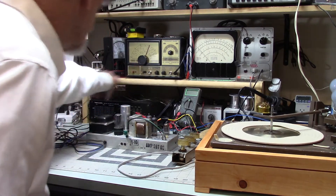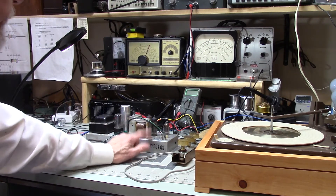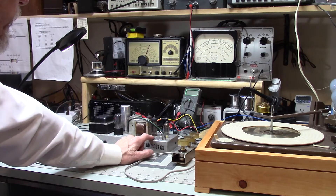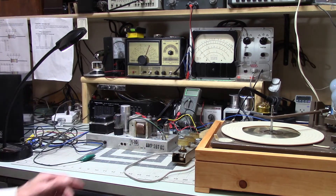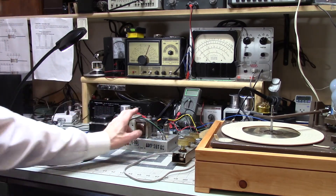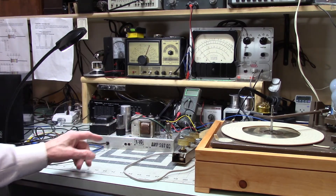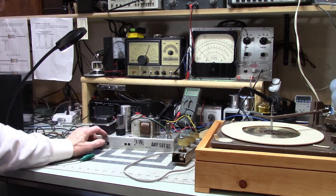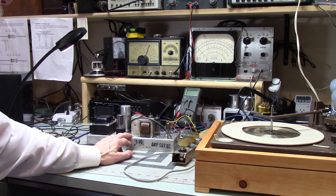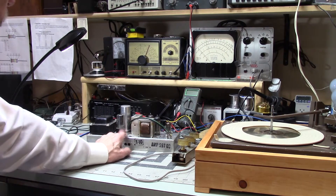Maybe the problem is that today we have so many noisemakers on our AC line that this amplifier is just picking up noise on our 120-volt lines here in the US. There's also an across-the-line capacitor — it's a disk capacitor but an older one. So maybe that's no good. I am going to change it, and I also want to put a fuse in this — I haven't done that yet either.